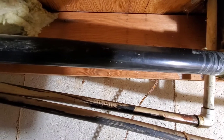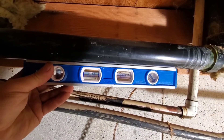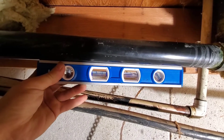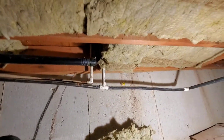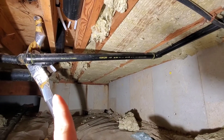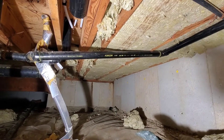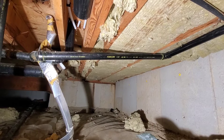This is our sink drain. You can see it is at least dead flat — and then you see the left bubble right here, that is back-grading. We have no straps on our water pipe. This piece is grading very nicely, but we have a 90 there, which you can't do on horizontal.